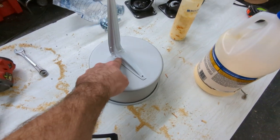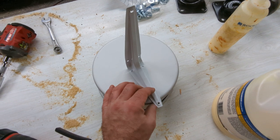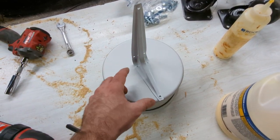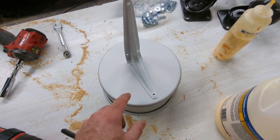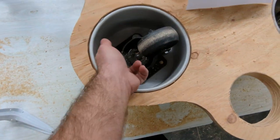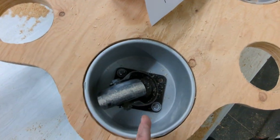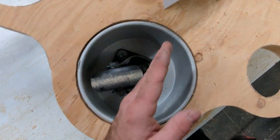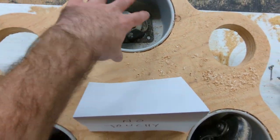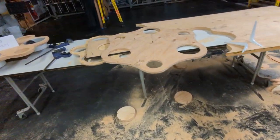The caster wheels have a rectangular steel base, and because the pan sits inside the tube, the bracket starts out at the rim. I may need to bend it over the corner. I want the long aspect of the rectangle oriented radially — I've been drawing a line from the outer point of the circle to the center and putting the rectangular plates at 90 degrees to it. If you're not careful the self-tapping screw can come through and jam into the caster bearing, which would ruin its function.